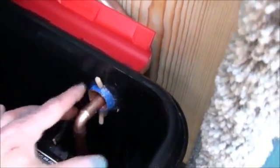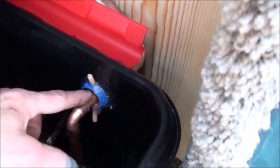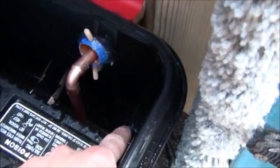It's actually two copper tubes — one inside the other. I have a one-inch outer tube and a half-inch inner tube. The inner tube comes down and goes to the very bottom of the box, about an inch off the bottom — that's fresh air in. The theory is fresh air comes into the bottom of the box, hydrogen being lighter than air rises to the top and exits out the larger one-inch copper fitting. It's a pretty short run through the copper and out the side of the van.